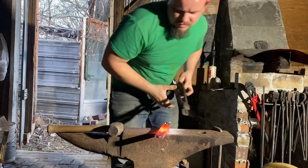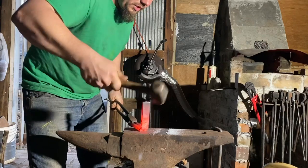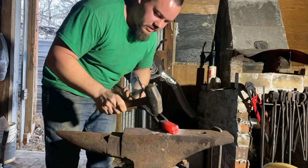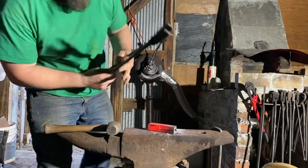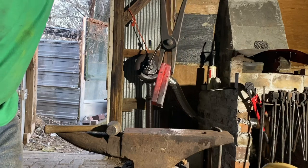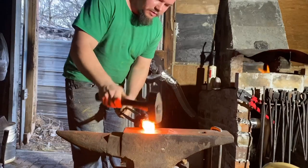On this one I'm testing all three methods to see which is easiest to forge for me, and I'm going to be destructively testing these to see which one is the strongest arrangement. There is our cut and folded gun tube — right now it's four inches, or 100 millimeters. Just light taps; we do not want to distort this.